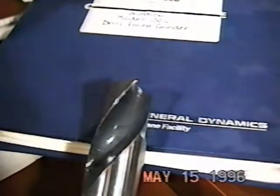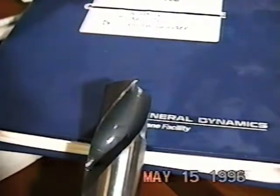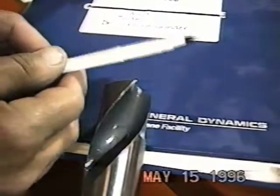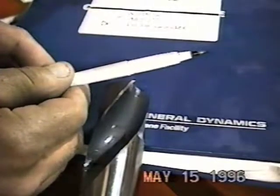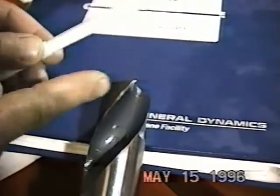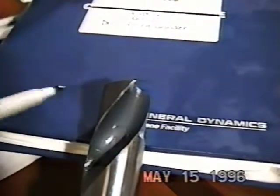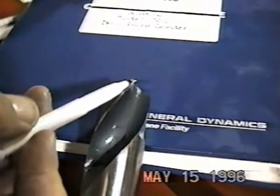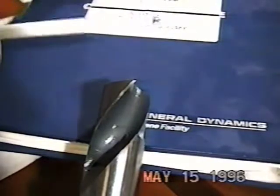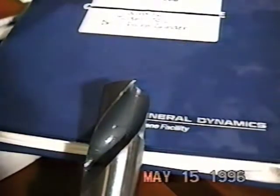Now in our initial setup and run, I referred to the clearance angle of the drill, which is one of the geometries that I need to have. Generally it comes out from the setting in the book. The first angle I'm looking for is the clearance angle — the slope of the grind relative to horizontal. You can see this drill going downhill, and particularly at the point you can see that there is a very good angle there.